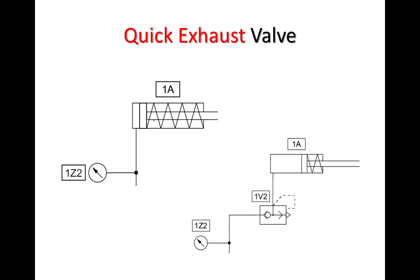Here there are two circuits: one without a quick exhaust valve and another with the quick exhaust valve. When air is trying to escape the cylinder, it has to go through very narrow tubes or lines, and at times these lines are very long, flowing through different valves — five-two valves, three-two valves, and so forth — which slows down the flow of air. Therefore, we implement the quick exhaust valve, which allows us to quickly and rapidly channel this air all the way to the atmosphere without passing through these narrow lines. This is the actual benefit of a quick exhaust valve: it is placed near the cylinder and allows a quick escape to the atmosphere.